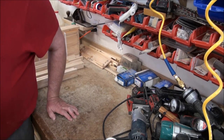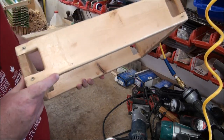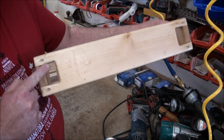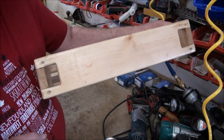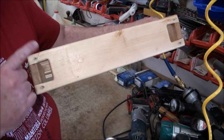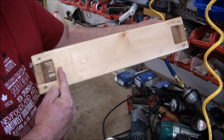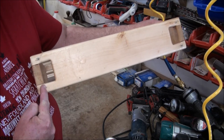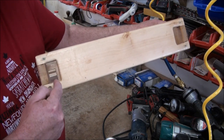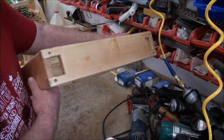As you can see on this jig, the challenge making it is always cutting this section out — that's a little bit of a crazy thing to try and cut. So I'm going to eliminate that. What I'm going to do is make each of the four sides in three pieces each — a center piece and then a bottom and a top piece — so I don't have to cut that out. All I have to do is glue the three pieces together and that should suffice.